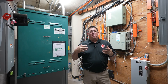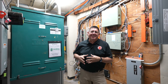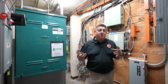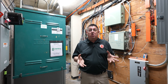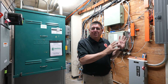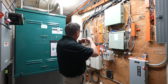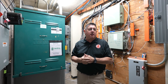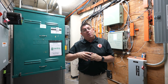Over my shoulder there's what looks like a bit of spaghetti — this is not an Italian restaurant. This is the phone system. For many of us, walking in this room, our eyes immediately go to this and we think, how am I going to look at all of this? Well, there's great news for the commercial property inspector: we don't have to. Within the ComSOP, the low-voltage system is excluded. This is where all of the phone and data lines for the entire office space run through. If you want to take a photo, great; if not, just note that it's a low-voltage system.